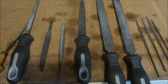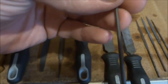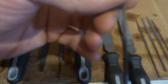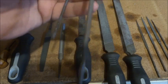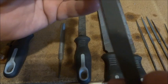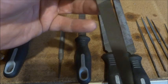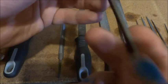This one — actually a needle file — is called a rat's tail. It's tapered all the way to the end, right to a very fine point. So the difference between that one and a chainsaw file is that this one tapers all the way to a point like a rat's tail. Another one I use a lot is a knife file — it's sharp on one edge and it's got a safety edge on the back.